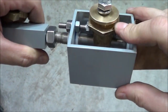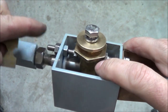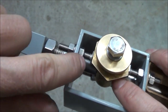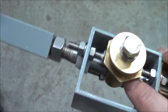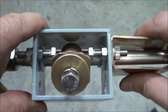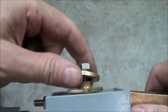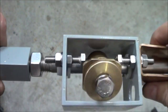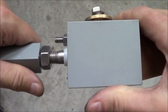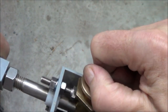And then on the other side, this is the side that attaches to the reverse bucket lever. These locker guys fit in here, and so I had to fill in this space because the locker's not there anymore. I filled in the space with a little bit longer bolt, and then I kind of locked it down, so there's one on each side. So it's pretty easy. This kind of flaps around, but once the whole thing is bolted in, it'll be pretty much stuck in place. So now it just does that. And the whole thing still moves back and forth, and if I grab a hold of this thing, I can move it, it doesn't lock.